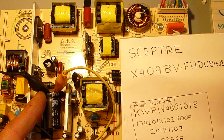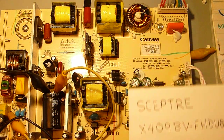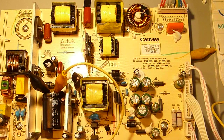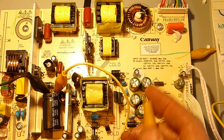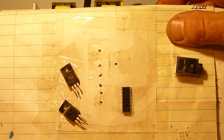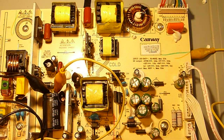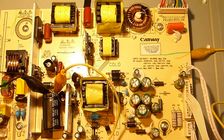If you use this technique, make sure you don't apply too much current. In the old days it was fairly common to jump the fuse, plug a TV in, and watch what smoked — and you could often get away with it because the traces on the circuit board were big, so blowing a trace was no big deal. But nowadays with all these surface-mounted components, forget it. You don't want to be blowing up traces or taking out components that weren't bad to begin with. Use this technique cautiously.